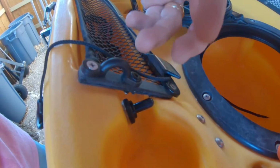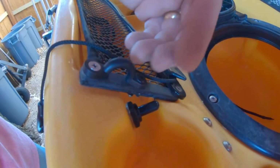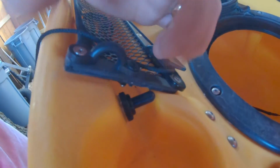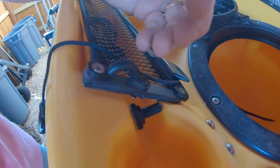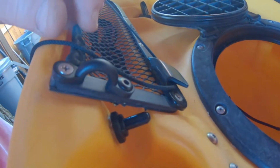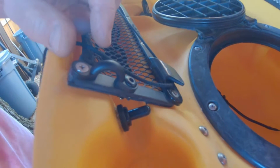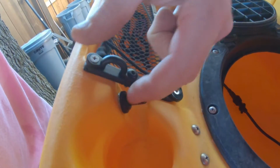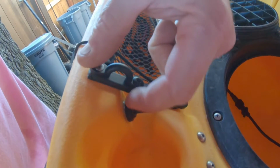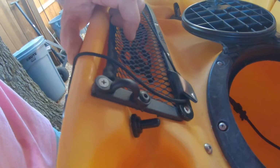However, I did land all the wires, soldered them to the terminals, and used marine goop and gooped the entire terminal block on the back side here. So it is completely sealed from the elements. And right here you can see that this is sealed as well. This boot has a brass threaded nut, so this is a waterproof boot over the switch there.